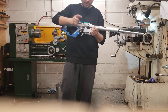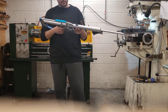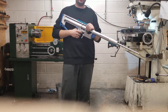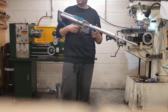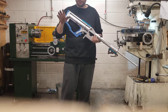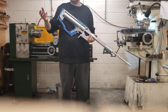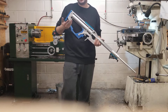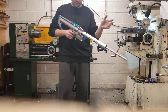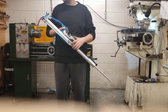It has my usual initials and a part number, and no holes on the grips — you can engrave it or do whatever you want. To get everything water jet cut I had to get all the Calaburn files into a usable CAD format, because the way Captain Slug has it, all parts are in one DXF file. On an industrial machine, tiny parts just fall through and you can't tab them when everything's in one file. It was an unforeseen pain — I had to redraw everything; they're all in Fusion now.